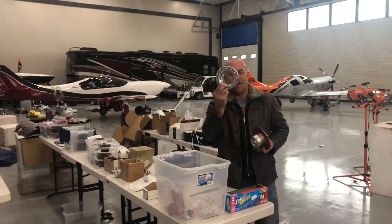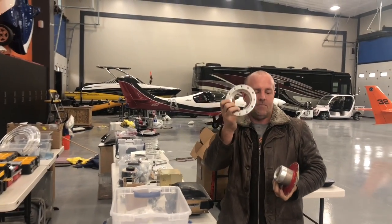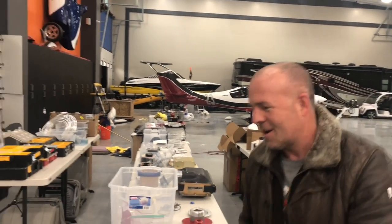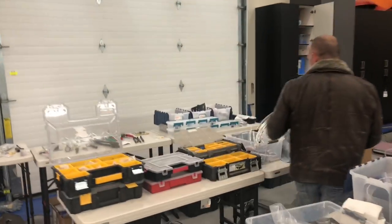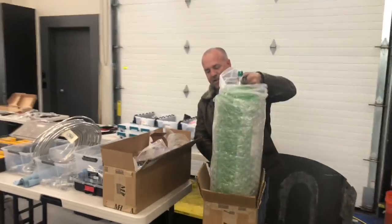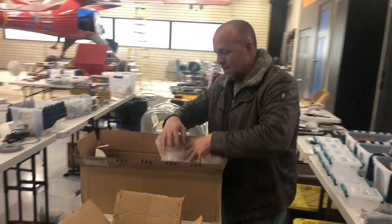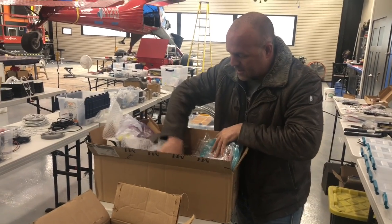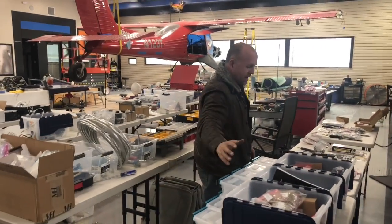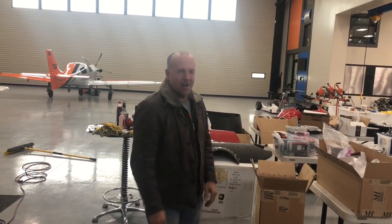Little things take a long time - sounds fast but that bracket is for the new fuel cap that can handle jet-A nozzles. That's the low-lead nozzle, so I've got to machine a bracket that goes from this size onto this plate - a unique shape, easier said than done. I've got a zillion fittings and parts: all my vent lines fittings, and a complete oxygen system since this plane is going to be capable of 28,000 feet. A bush plane that goes to 28,000 feet - I've got a four-place oxygen system with all the relays, contactors, on-demand pulse delivery system, and all the mounting brackets.